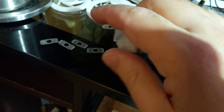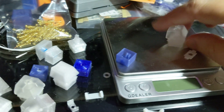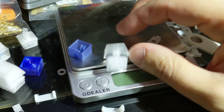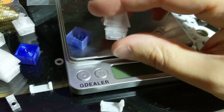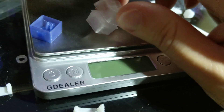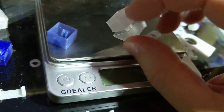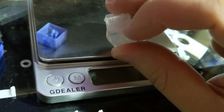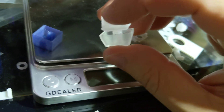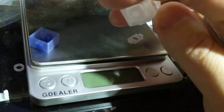You can see that they were printed repeatedly. The key is, I think, the 13-millimeter spring. Well, there are a lot of parameters I've got to get right — make more parametric, because right now they're hard-coded values. This little cutout on the side of the switch is at a certain height from the bottom, and it has to do with the actuation distance and the bend of the spring. I haven't got the math right for that yet, but I'll get there.